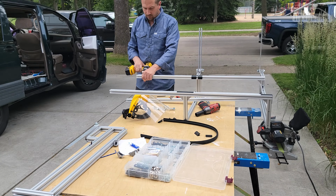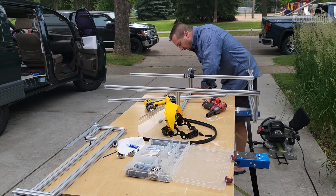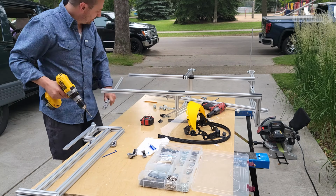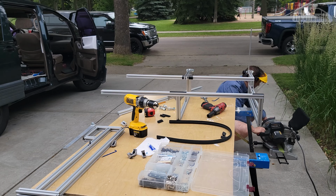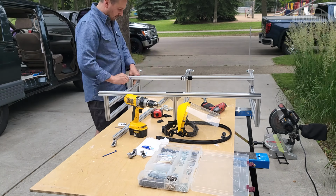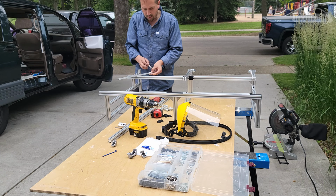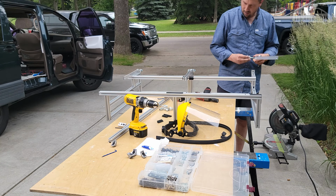I then drilled the rest of the access holes for the passenger side support rail. I also needed to make a few changes to the internal support bars to accommodate the narrower footprint. This required multiple access holes to be re-drilled, as well as ends to be retapped after cutting the previously tapped ends off in the shortening process. Once the cuts were made, I swapped the support arms from the inside to the outside and checked my measurements before retapping the cut ends and reassembling the passenger side.